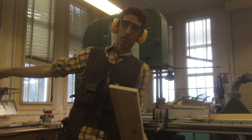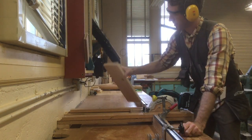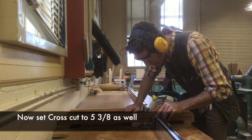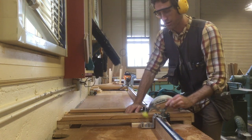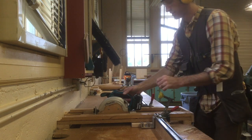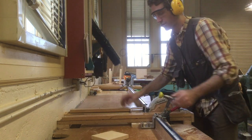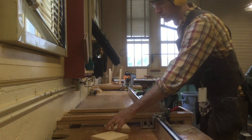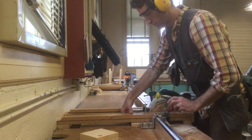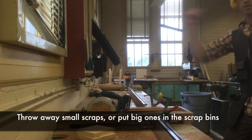We're going to head back to the track saw and cut it to five and three-eighths by five and three-eighths — three different sections — so we'll have our three pieces. Set up on the straight-edge side, set to five and three-eighths, tighten that down, clamp all the way until you hear a click. Cut, release the clamp — a nice clean square. Do that two more times until all three are nice and even.